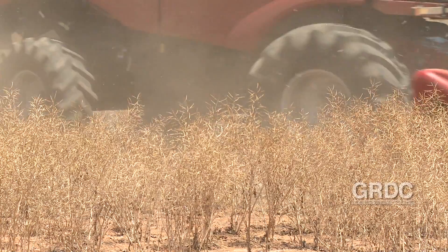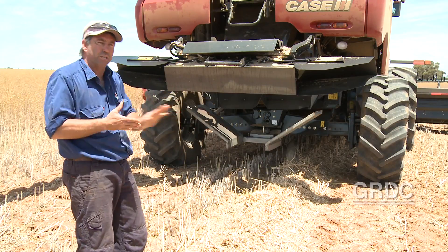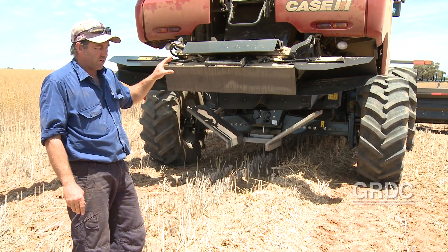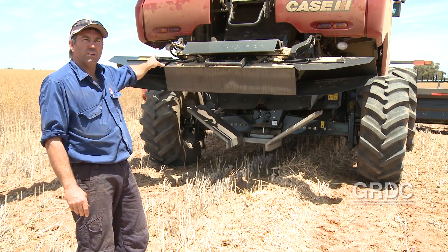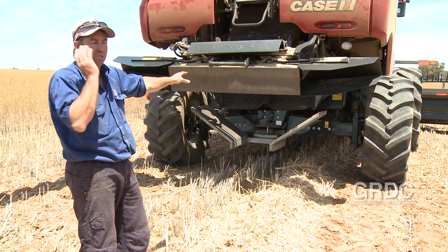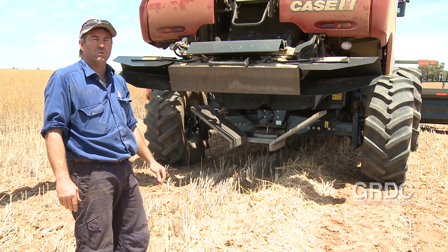In canola, if we ever stop the header you back up straight away, purely because if it's a very bulky crop it will definitely stop on the windrow, and you need to back up to clear the bottom so you can start again. That's where you have your biggest issues with a windrow on the back — in canola, and in particular going into the night where it gets a bit tougher and less brittle. This year we've put cameras up to the side at the back, more for our casual drivers who aren't familiar with what we're doing, so if you stop and back up you can see the windrow, and if it's not clear you can get out and pull it out before the back of your header fills up.